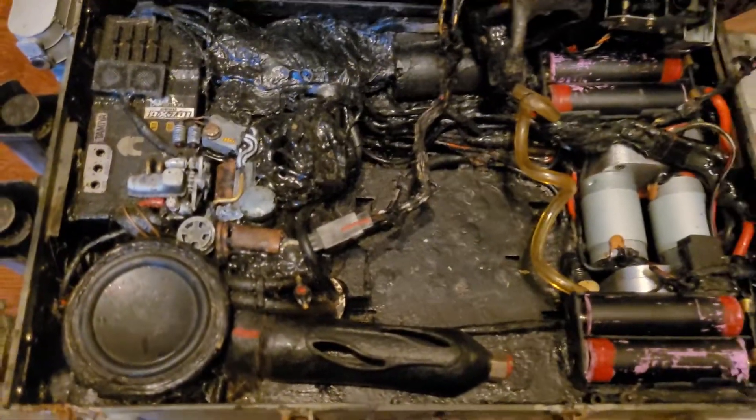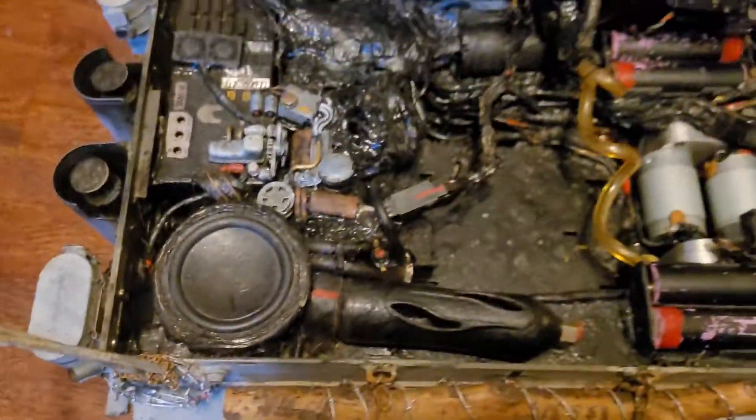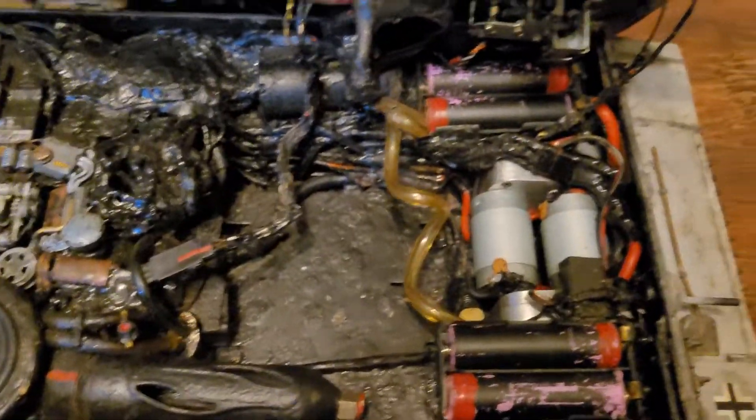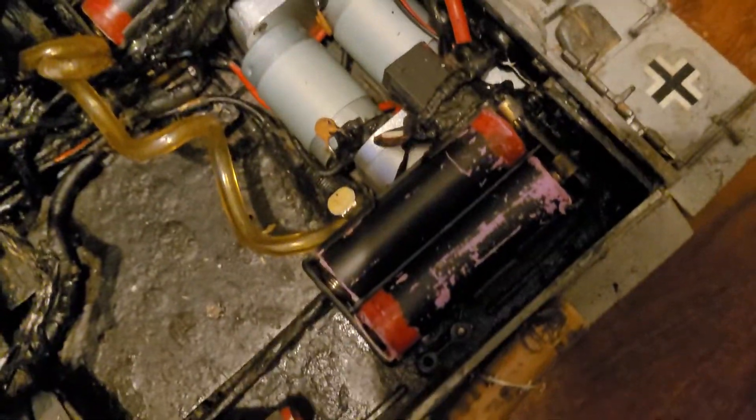You don't get that boxy plastic tank noise. Usually if you run things free air and then sound deaden the areas that rattle in the tank, you'll get a deeper, richer tone. I'm into speakers, so building speakers is kind of my thing and I knew that would sound a lot better. Anyway, back to the gearboxes — there they are, shoved in. I used 18650s for my power supply.